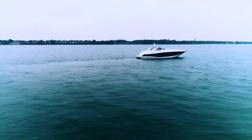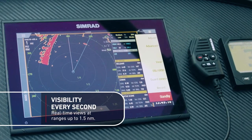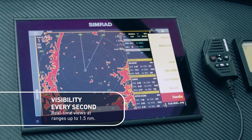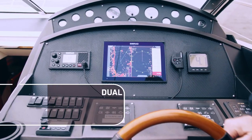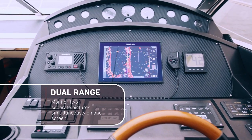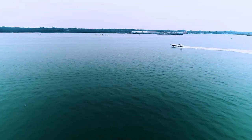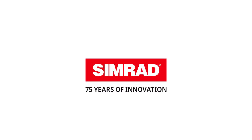What I also like is that when you go to one nautical mile or lower you get one sweep per second, which is really good because it means when you're in close proximity to other vessels it's almost real-time movement. Plus it has a facility for dual range radar, so rather than going up and down the ranges and losing the picture as with traditional radars, it has the ability with one radome to have two separate pictures. In terms of the equipment, I feel very safe using the radar and could go out in weather that perhaps we sometimes just shied away from.